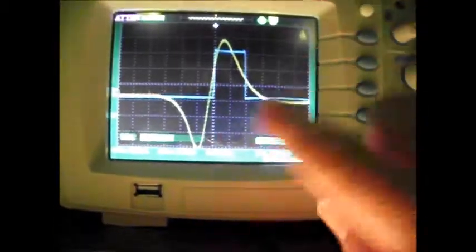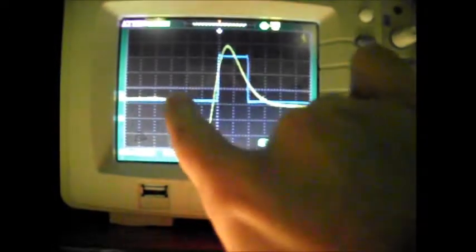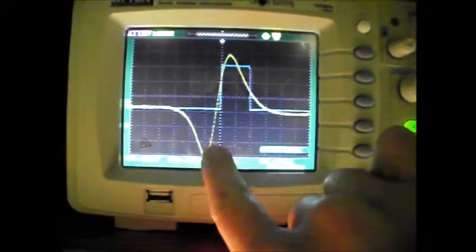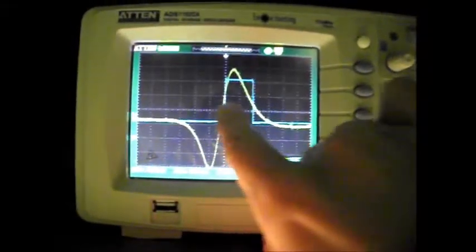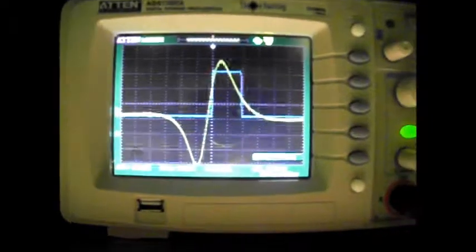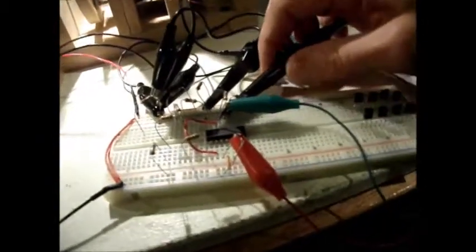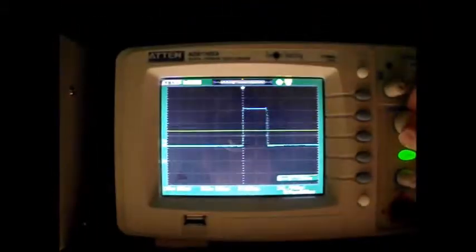You can see my threshold right here — I've used a voltage divider to make it trigger. I figured that it was best, rather than to trigger off of this slope which could probably vary quite a bit and isn't necessarily as steep, that this was the fastest moving slope, and so I wanted to trigger here. That's the way I wired it. And so now I'm going to move my test lead so that we're looking at both outputs.